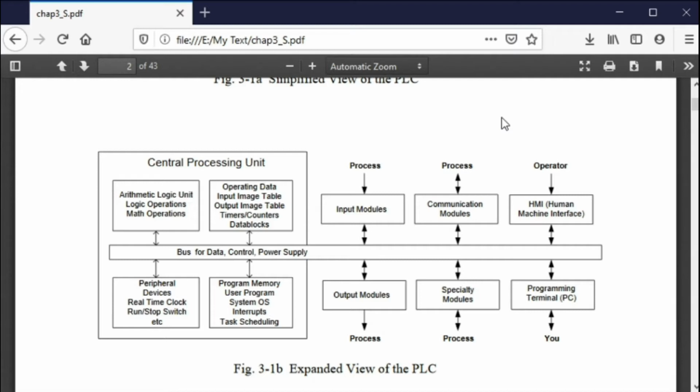One is a watchdog timer, so that if you don't get through the program in a certain amount of time, it'll shut down in an orderly way. Another is predictability if you have a math error, or something that causes the thing to fly off into Never Never Land. In other words, you lose your program counter. What do you do? Most systems just shut down, but you don't know what the outputs are going to turn on or off. With a programmable controller, you can control those things.